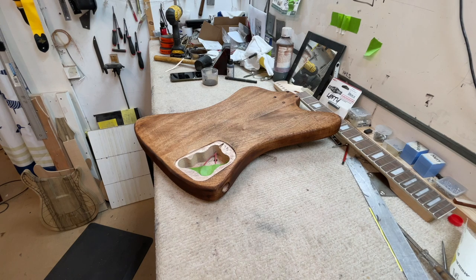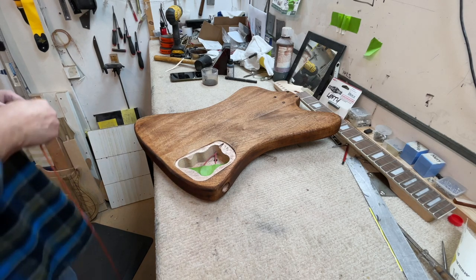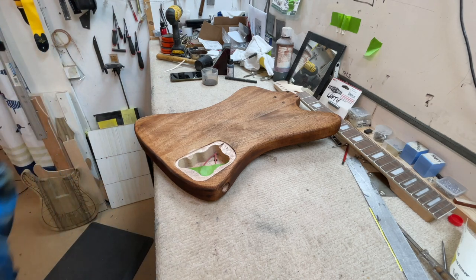Now for the first 2 or 3 layers, I wouldn't do any sanding back, because one of the things they often say, and they do it with all kinds of finishes, is to spray a dusting coat on your blah blah blah. They might be talking about nitrocellulose or something. They'll tell you to spray a dusting coat on there, and then before you know it, the next thing they say to do is to sand it off with 600 grit.